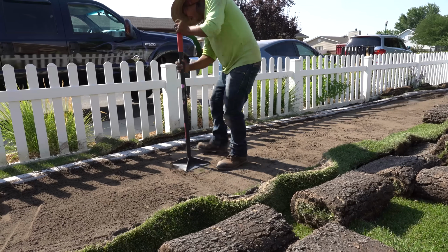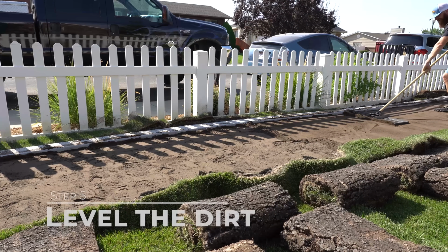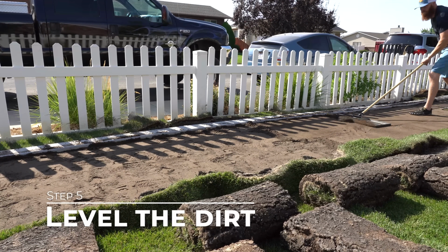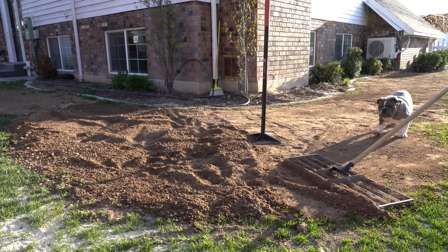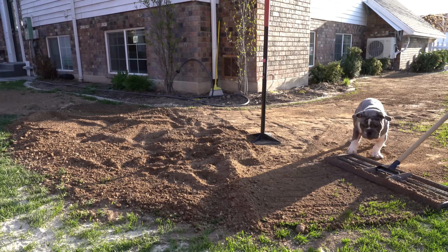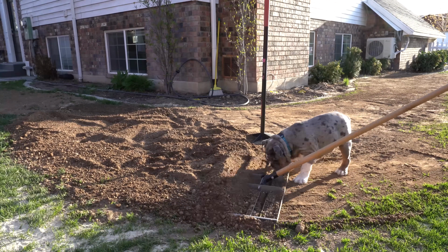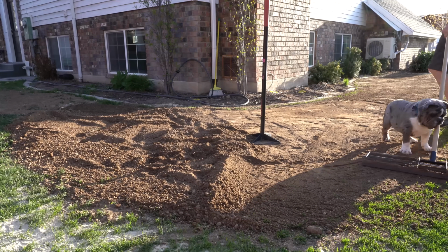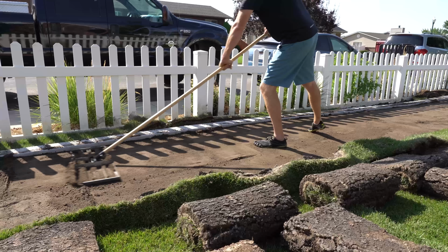Now that we've got the levels to where they need to be, that leads us to step number 5, which is leveling the dirt out. Now there is a very handy tool out there called a Levelawn. This tool is very handy in the fact that it helps push dirt up and through some grates and leaves you with a silky smooth surface. Now I'll have a link in the description of the video of the Levelawn that I chose to use for this project, but it saves you a ton of time if you have enough money to purchase the device.